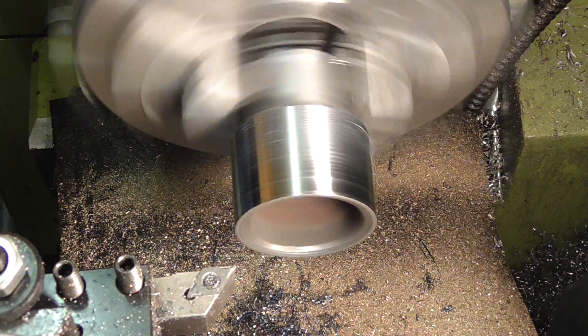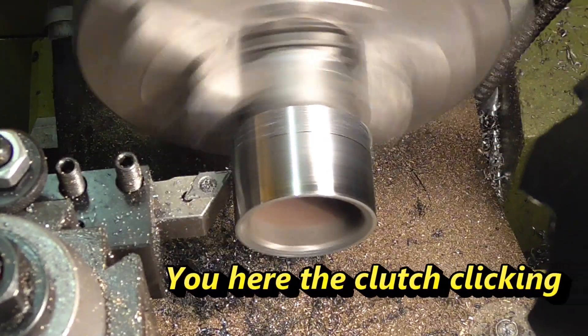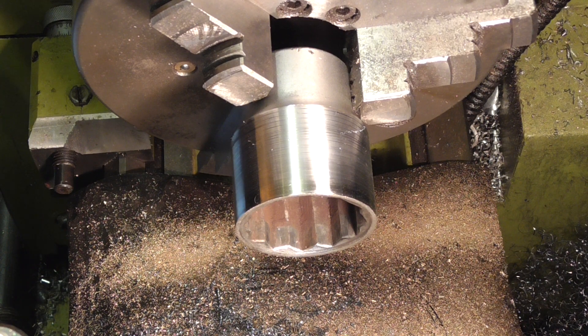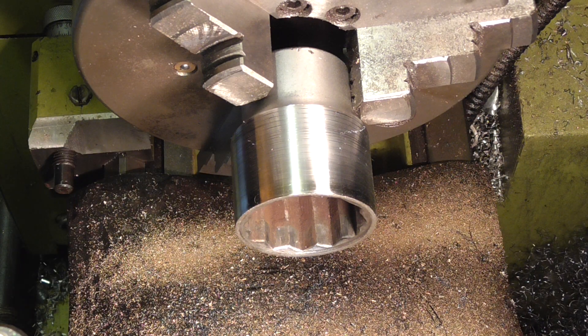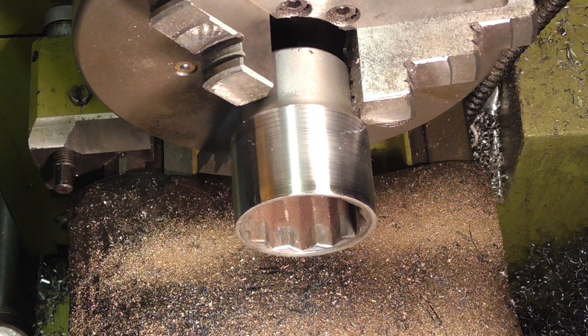I don't know whether there's something wrong, but my clutch is slipping on my drive. It appears that this video is going to lead on to another video sooner or later, because it looks like the clutch for the carriage feed - basically it's an anti-jam clutch or crash clutch or whatever you want to call it - it's designed to break loose if there's too much load on the carriage, but it looks like it's had it. There's something wrong there, there's a spring hanging outside of it, and it's not providing much torque. I've adjusted the one which looks okay to apply a bit more pressure, because there's two springs, but that's going to need rectifying before too long.